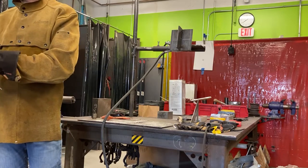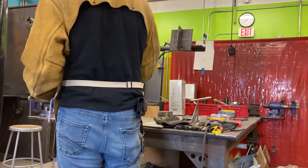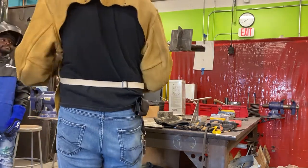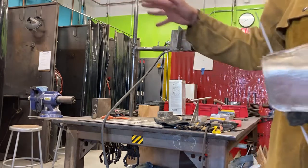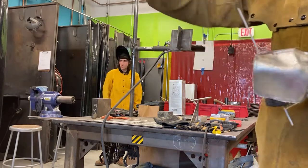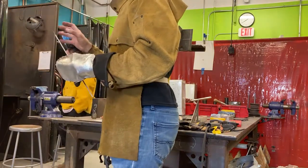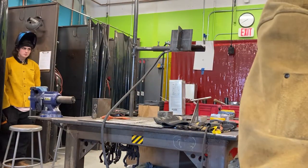So this is a 3/32 rod, and if I check my thickness here, Emerson gave me this funky little gauge. My measurement is 0.099. So I know that I need about 99 amps or so. Actually, it should be about 95. I mean, that's a little sketchy. It's usually these come out to actually 0.093 is 3/32. So my minimum size is going to be 93 amps for my power. Now, remember, that's just middle. We're doing a horizontal weld, so I may want to do a little bit less. I don't know yet. So I'm going to start at 95 and hope for the best.